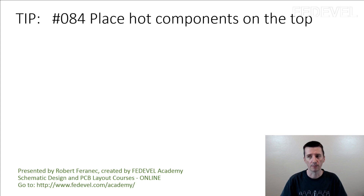I'm suggesting this because a couple of times I have had to place some components which were really, really hot on the bottom. Components like a processor — I had to place it on the bottom of the PCB because of how it was mounted in the enclosure and in the system. And it was quite tricky to find a heat distribution solution for this kind of system.